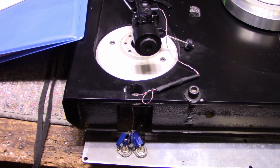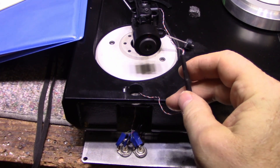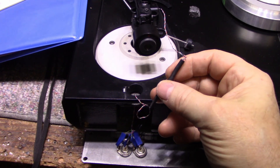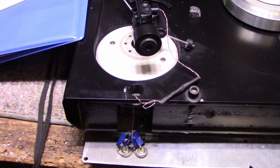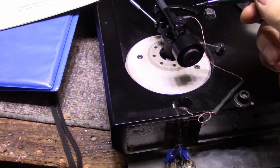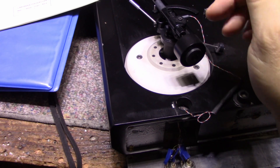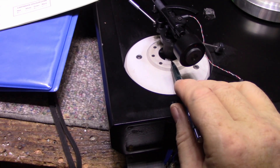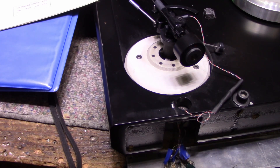We've got some fixing to do. I think the best thing is to rip out all the old wiring and start fresh. I can probably reuse this wire if it has continuity — I'll cut the splice open and re-splice it more compactly. I think the best solution is to have the wire come out the back of the tube instead of the side, then run it down alongside the tonearm shaft between the three jaws and out to the back, terminated properly.